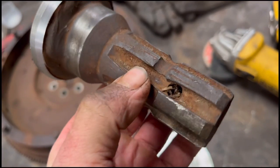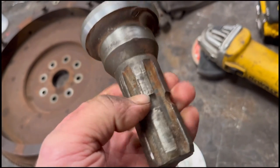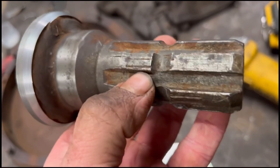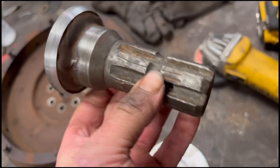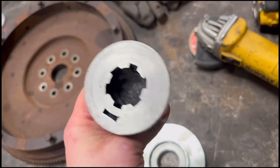And I'm not too worried about welding that because I don't think it's been heat treated. It's soft. You can mark it with a file. You can see all the bits and marks and that on it. So I think that's just ordinary steel. You know, it's not hardened.